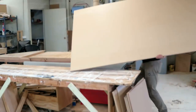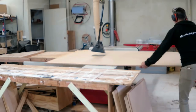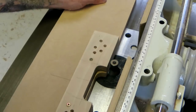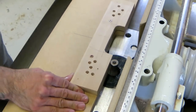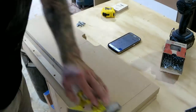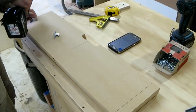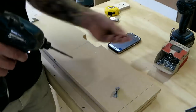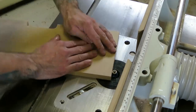So then I started cutting up MDF for the drawer parts, so I won't bore you with a lot of squares being cut. After I made the drawer fronts, I just used my little handle jig here to create the handle, and then work out where I needed to put the brackets on the front for the soft close drawers, and then give all the edges a roundover.